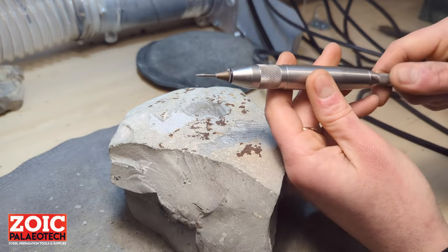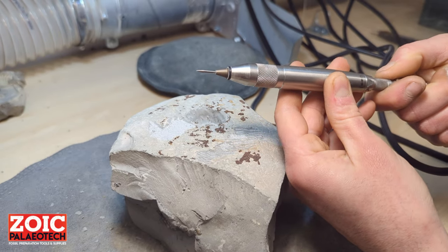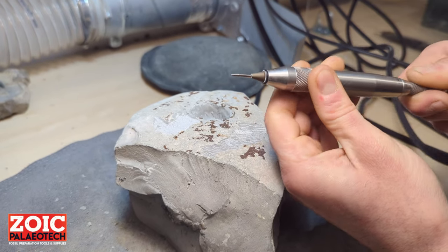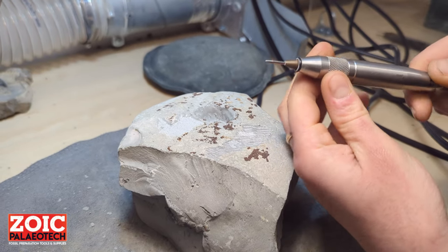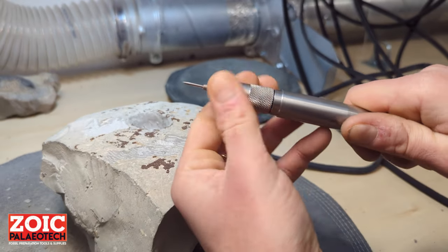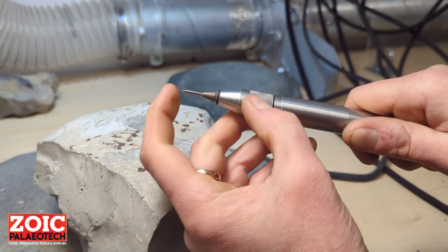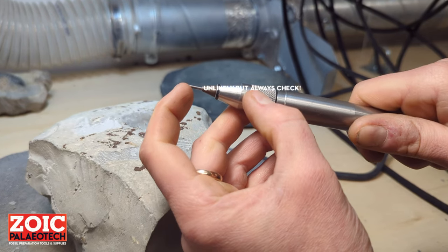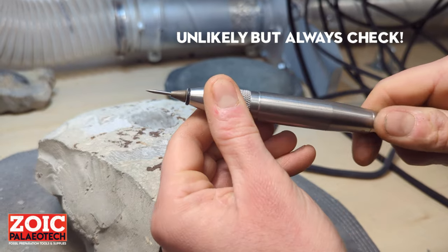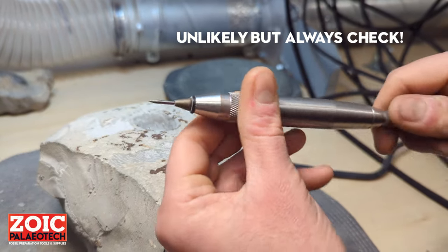Because of the on-off mechanism of the trilobite, which is essentially a throttle valve, when you turn it on and off and adjust the power, make sure that you are not inadvertently unscrewing the head. If you do happen to unscrew the head, the length of travel of the stylus can be longer than intended and it will break the spring. So just make sure before you use it that the head is properly tightened on — just hand tighten.